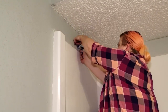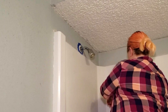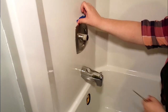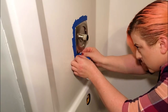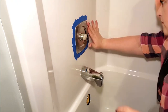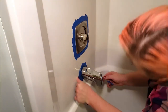Since I just got done painting the bathtub and shower, I want to protect that surface and not get spray paint on it. So before hanging plastic, I took painter's tape and carefully outlined all of the fixtures, trying not to leave any gaps between the tape and the fixture. I spent more time prepping the area and taping the fixtures off than I actually spent painting them, just to make sure I wouldn't have to go back and touch up the bathtub afterwards.